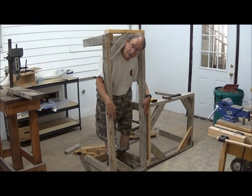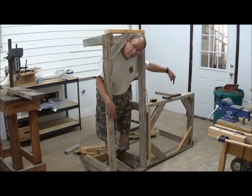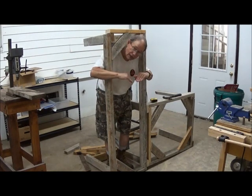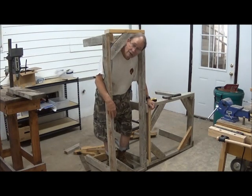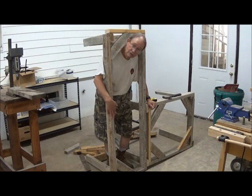This table is going to have a steel top, and that top is going to be 1 and 1/8 inch thick, which is pretty thin to have a long unsupported span. That is the reason for the very heavy construction of this table, and that's also the reason we're going to put a cross piece across the middle here, so when we put the furnace on it the table top doesn't sag under the weight. This long extension here is to allow a chill plate to be put down. When the blades are taken out of the furnace, they're going to be wrapped in foil, placed on an aluminum plate, another plate placed on top of them, and then allowed to slowly cool to anneal and hopefully not warp on our longer blades.